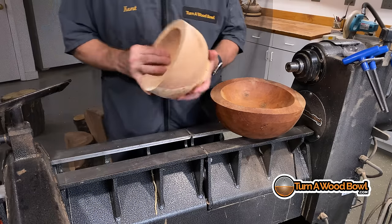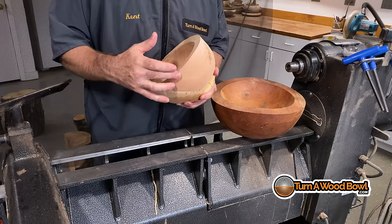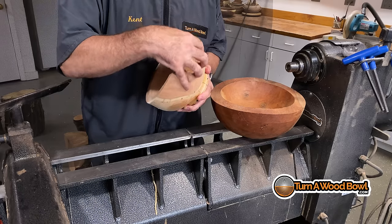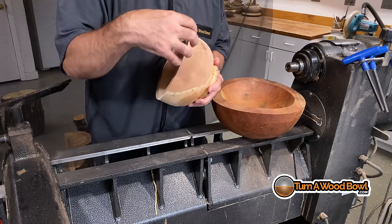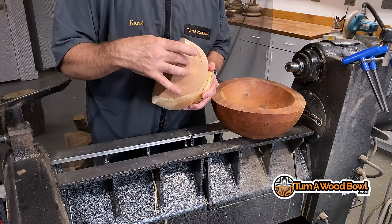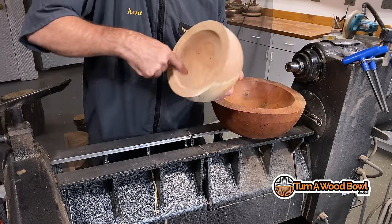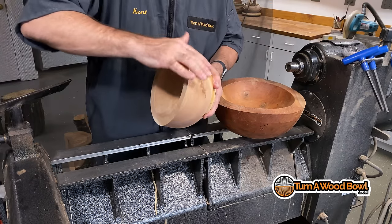Now, what I'm going to do with this is I will actually use Anchor Seal, and I'll put a link to this in the description below. It's a sealant product that slows down the moisture coming out of the end grain. I'm only going to paint the end grain on the outside and on the end, on both sides. I'm going to leave the side grain exposed.